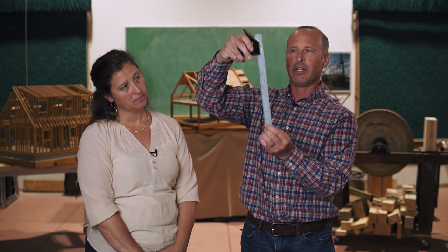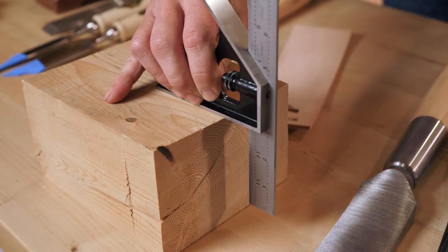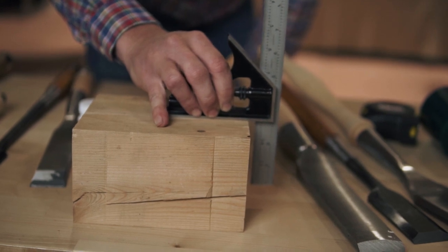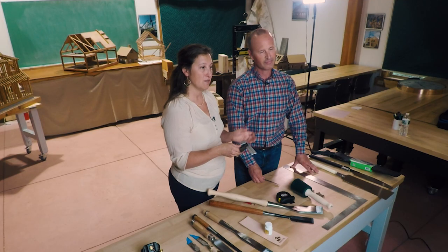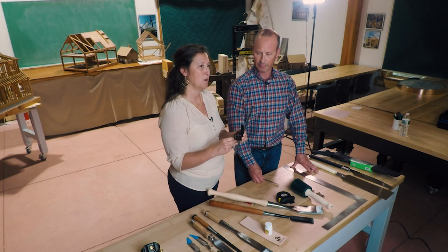This is a combination square; it's made by Starrett. We like the satin blade because it eliminates glare. This is a tool that you'll use for checking the depth of a mortise — the blade slides up and down on the head. But perhaps more important than the depth is maintaining a 90-degree cut into the mortise. Obviously if your mortise is getting wider as you're chiseling down, you're basically ruining the mortise. So you would use the combination square on the surface of the timber and extend the blade down to make sure that the side of the mortise isn't wandering out. We really love the Starrett combination square because it's an American company right out of Massachusetts. They warranty the square of their tools, so if you drop yours on concrete and it gets out of square you can send it in for recalibration. Starrett is more well-known for their hole saws, but they have the most incredible measuring tools.